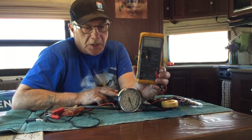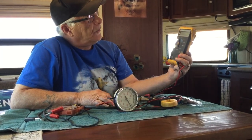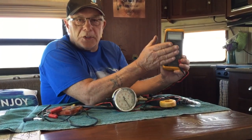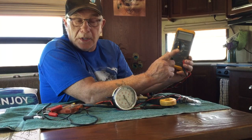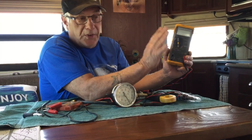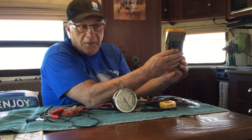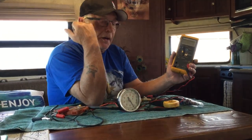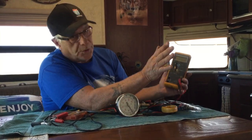This one will tell you voltage and amperage — a little bit of amperage. This one here is an automotive one, so it tells you RPM and point gap, which some people don't need. Plus it does temperature, which is very important, because you can put the probe in a bucket of water and it'll tell you the temperature — very, very accurate. I use this a lot for my air conditioning because I fill by temperature, not by weight. I put the temperature probe in the AC and when it reaches the right temperature, I just quit filling.